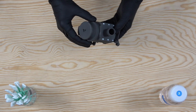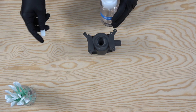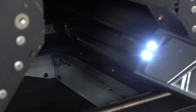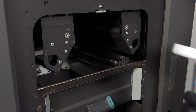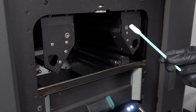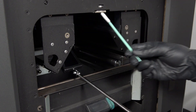Below the IR sensor is the IR sensor cone, which directs airflow away from the IR sensor and down into the print area. This airflow keeps the IR sensor clean from laurolactam and other contaminants while allowing the sensor an unobstructed line of sight to the print bed. Laurolactam can build up at the top of this cone, reducing the effectiveness of the IR sensor and causing print defects and even failures. Every 100 hours, use the telescoping lighted mirror to inspect the IR sensor cone above the print area, between the camera lens and the upper laser window. To clean the IR sensor cone, wet a clean room swab found in your maintenance material box with ethyl alcohol and reach up to brush the sides of the IR sensor cone and the hole at the top. If the swab is dirty after cleaning, repeat with a new swab. The IR sensor cone is clean when the clean room swab comes away completely clean.